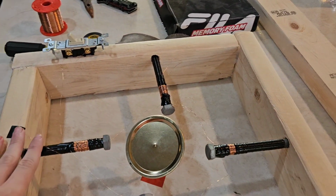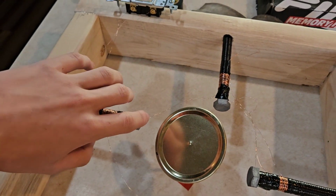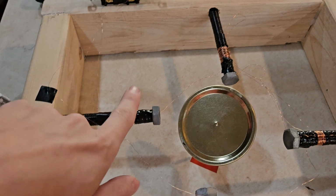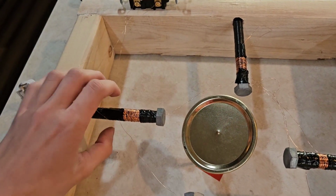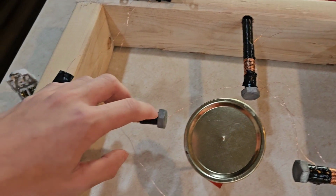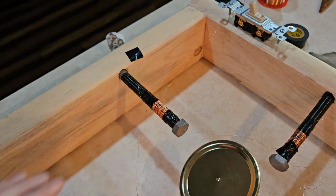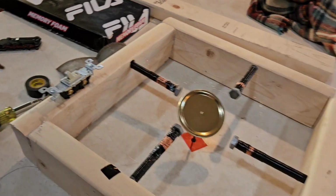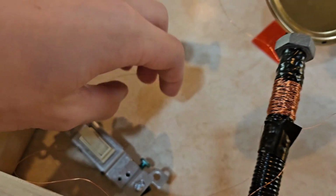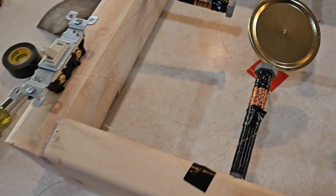And one of my predictions about this was correct. These bolts, right on the tips, if you put your finger on it, after turning it off, of course, got very hot. And that's called an induction heater. It's when a bunch of coil is wrapped around something that can induct heat. And so if this had stayed on long enough, theoretically these bolts could have melted. And as you saw in one of the clips, there was smoke rising right about here, either from this bolt or from this bolt. And my other prediction of tripping the breaker was incorrect. I did not think about how tiny the wire was when I was thinking about it. But what happened was all the electricity ran through this wire and caused it to vaporize.